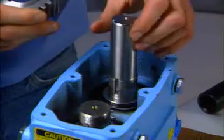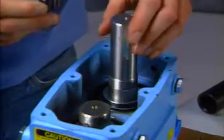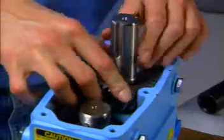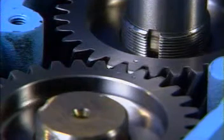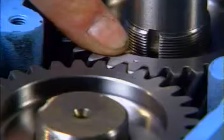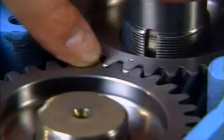You'll find it helps to put the rotors at right angles before aligning the timing marks. Then, slide the gear with the single punch mark onto the drive shaft and the gear with 2 punch marks onto the short shaft, again with the 2 punch marks straddling the single mark of the drive gear. The gears may need to be tapped into position.